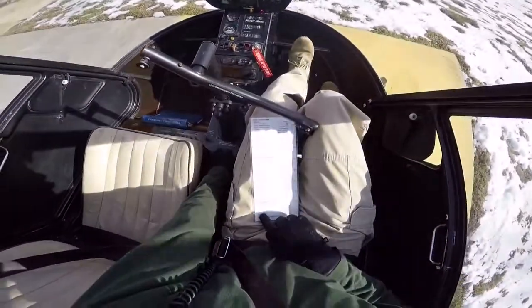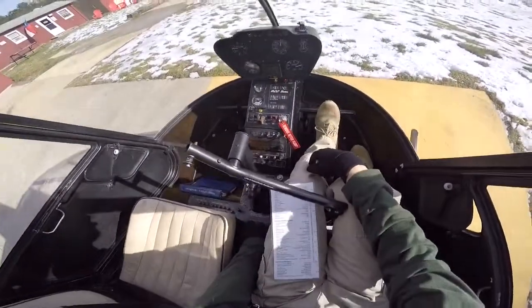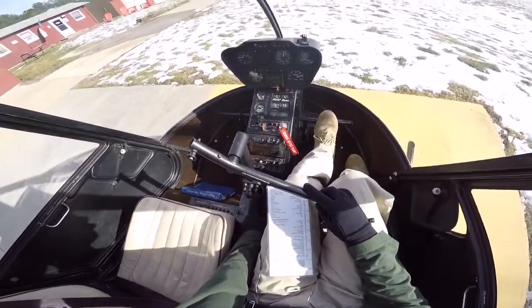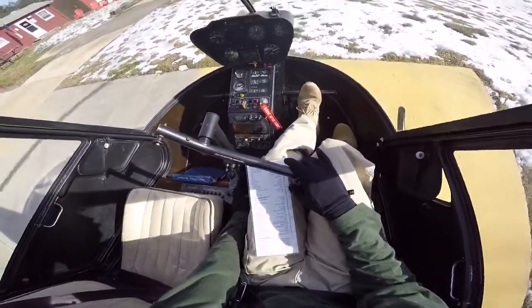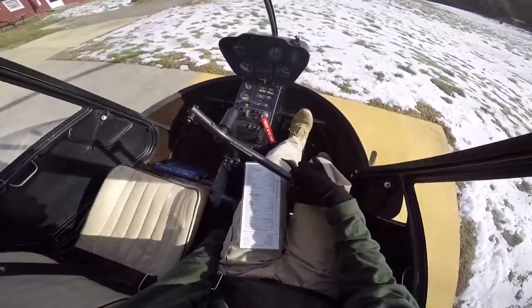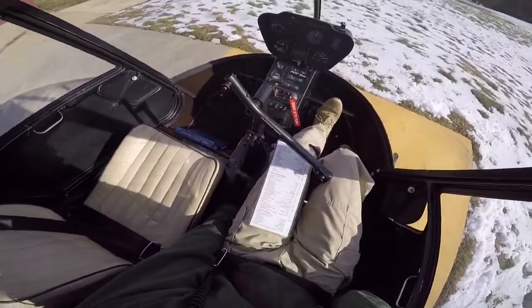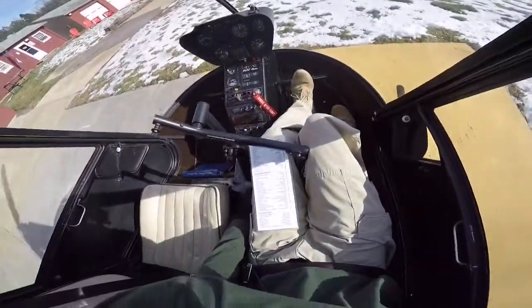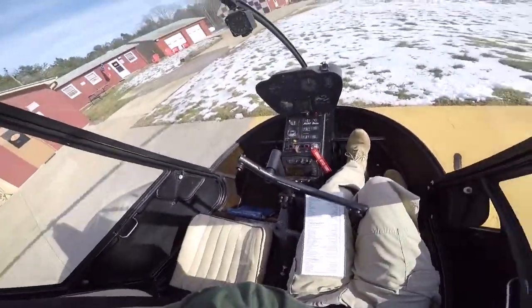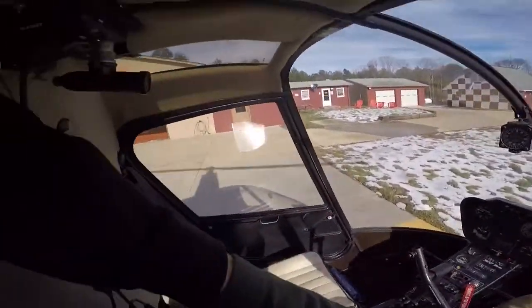Going to wait another 30 seconds and we're going to apply our rotor brake. There's our 30 seconds — here's my rotor brake up here, and I'm going to pull that. We're going to have 8 to 10 pounds of pressure on this because you don't want to pull too much and the chain is going to snap.